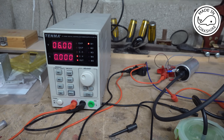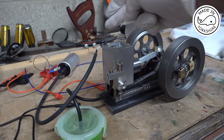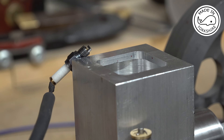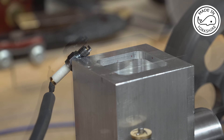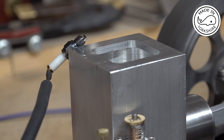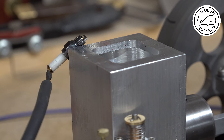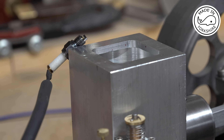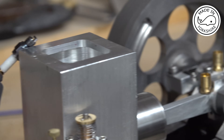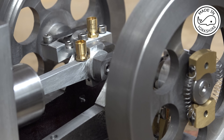So we're all wired up, and that's a spark plug that Simon Burt made and kindly sent me. Let's see if we can get a spark — hey, that looks good! I'll just check that it sparks on top dead centre — there, it's just gone. Looks pretty good to me.